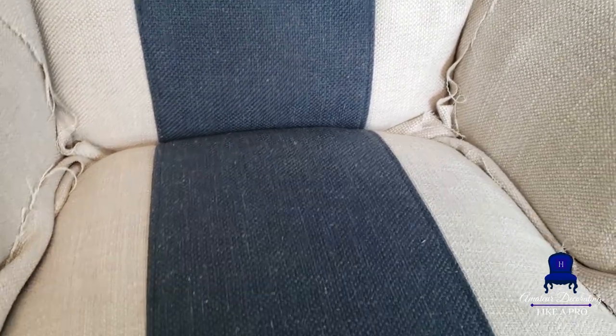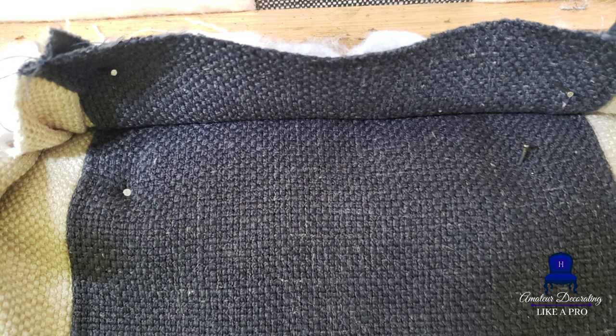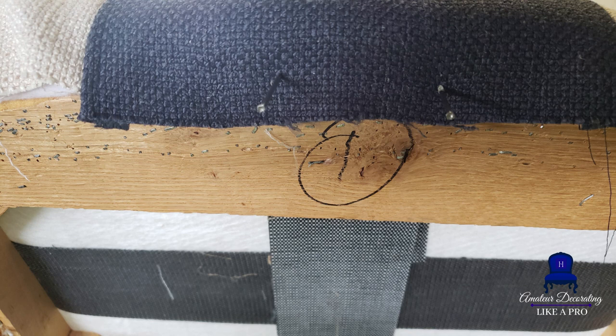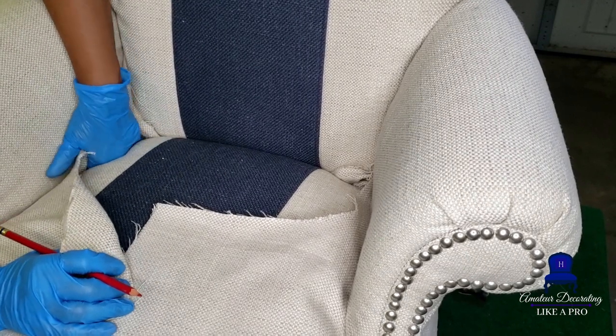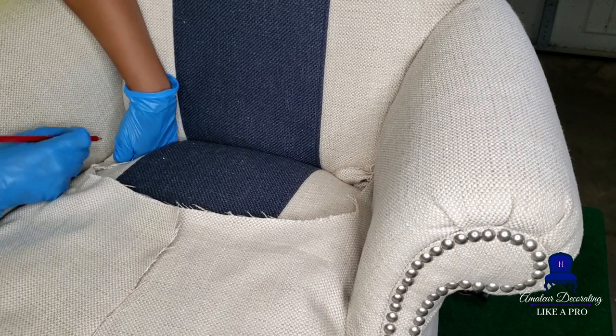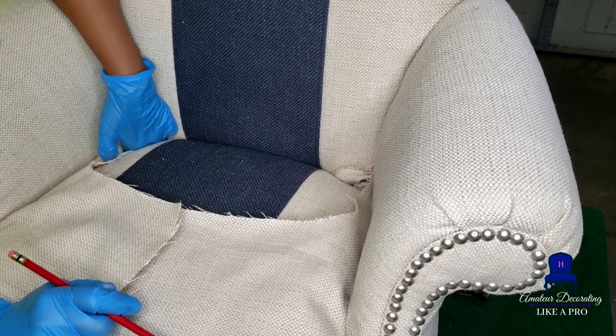I really like the topstitching on the seat cushion, and I have lined up this stripe from the seat cushion to the back of the chair to the outside back of the chair. I'm using tacks to hold the entire piece of fabric in place so that when I start to staple, I'm not pulling it off-centered as I'm stretching the fabric with the stapler. There are boards along the sides of the chair and along that front armrest, so I am marking those areas so I can cut the fabric away, tuck it under inside the fold, and everything will still look smooth.